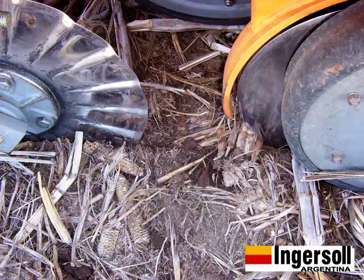This is an Argentinian photo, but I actually saw some of these discs the other day. You can buy these in Australia, but that's a fluted coulter, which I'm not a big fan of in the north. I do prefer to use a straight coulter, but you can buy coulters afterwards to cut through very serious stubble amounts. I mean, that's Argentinian stubble levels, and it does a good job.